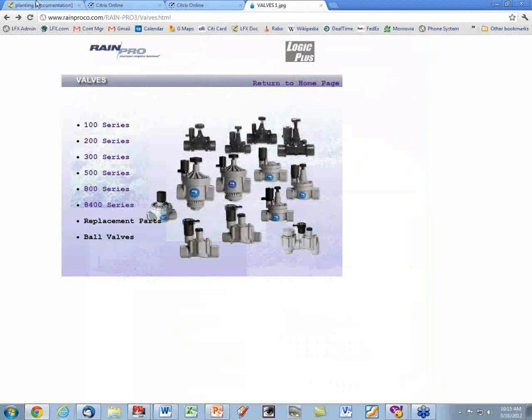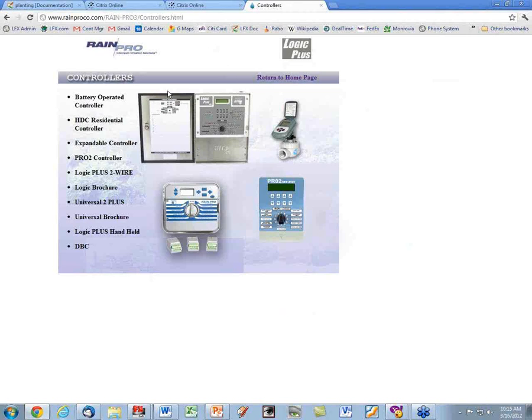Let me get back to the home page here. Controllers are really interesting in what you have to offer. I'm going to let you go into it, but they're two-wire controllers, and we recently had a fellow by the name of Bill Curtis do a webinar on general irrigation design, and his research indicated to him that anything under 32 stations seems to be more efficient to go with conventional wiring when you add up all the wiring costs. I don't think he was really looking at this controller. He was more looking at the major brand controllers like Rainbird, but he felt anything under 32 stations, conventional wire seemed to make more economic sense, and anything 32 stations and over, the two-wire system became less expensive, as wire is becoming outrageously costly today.